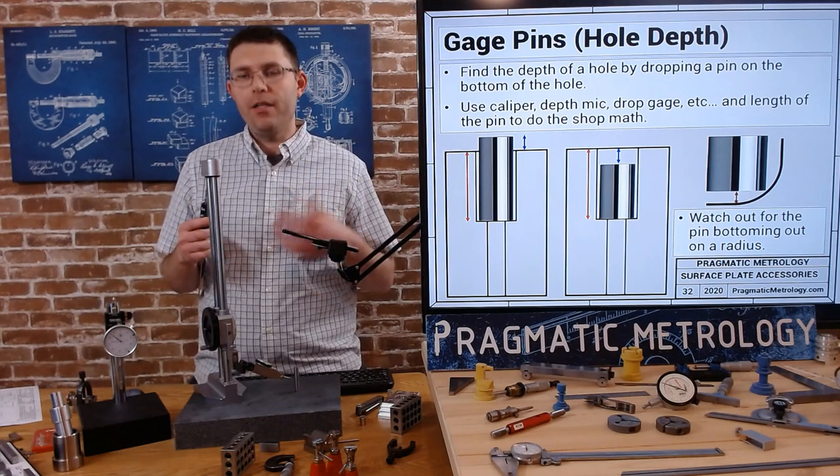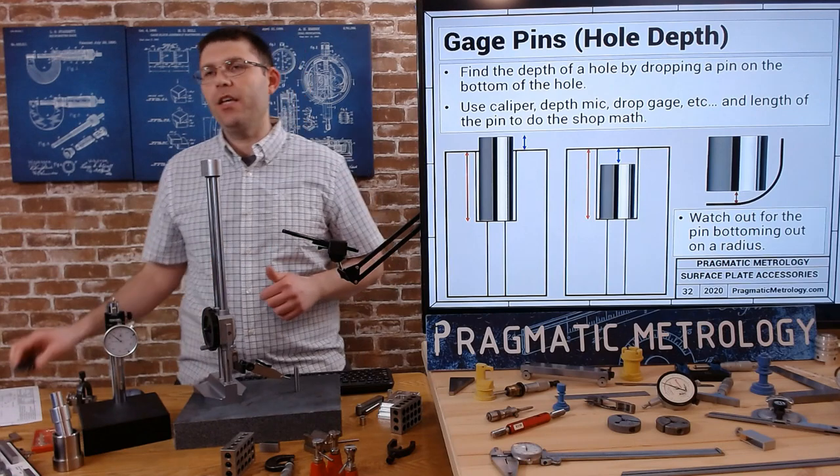The overall length of these pins is not critical by the manufacturer, but in reality these tend to be very parallel - you can run an indicator across these pins and see just a little bit of movement. Counterbore depths and stepped hole depths tend to be open tolerance, which lets you do this very quickly. Sometimes your alternative is to use the depth bar on your caliper or depth micrometer, and sometimes that's just not as desirable as dropping a pin in and checking it that way.